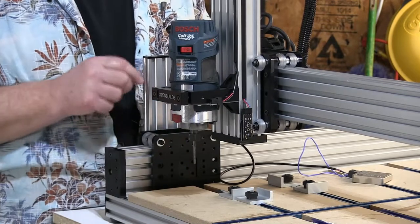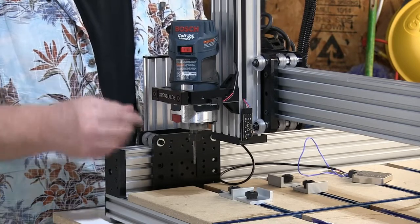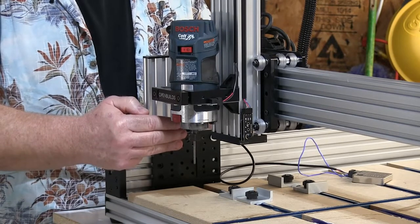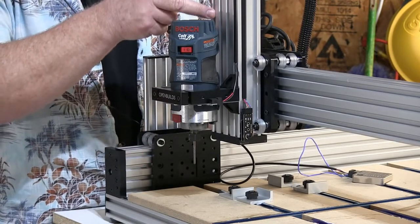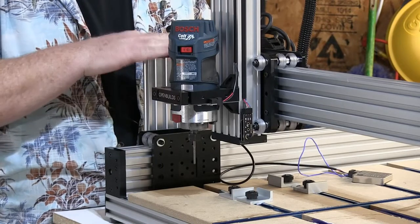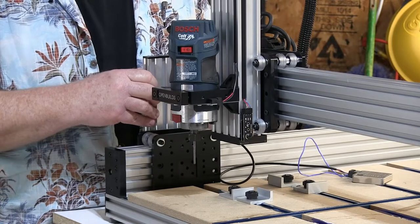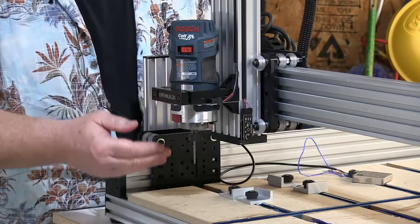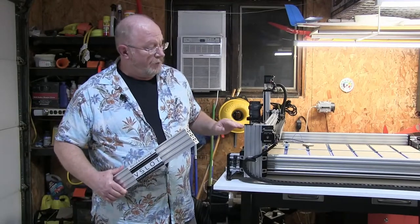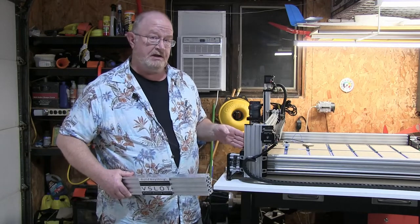So we're going to change these verticals right here from 250 millimeters to 300 millimeters, and they'll buy us basically another 2 inches of clearance head space. This C-beam is capable of handling that without additional reinforcement because this is really rigid. They just built on what they had as stock parts as opposed to custom cutting a part for more head clearance, and left it to the people who would build the systems to adjust it to their own use.